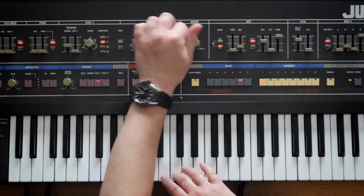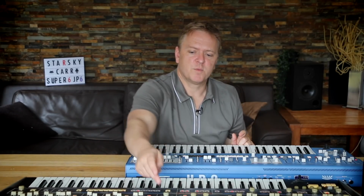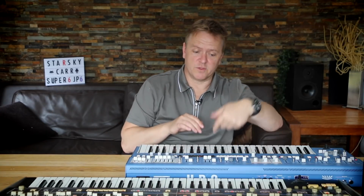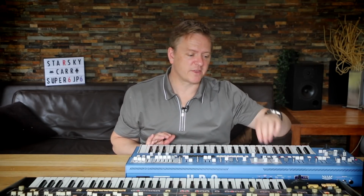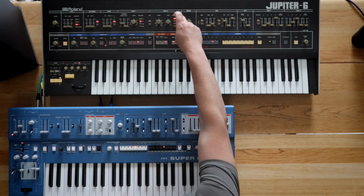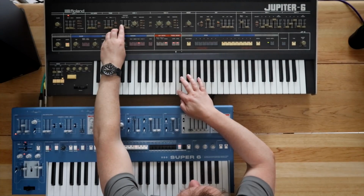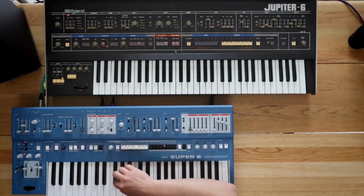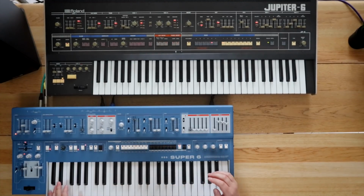If we modulate this one, for example, we're listening only to oscillator 1 there, but we can hear the different waveforms changing. The cross modulation on this one, we're not changing the modulation at all by changing the wave shape. DDS2 is actually on, which I think, after playing with it a little bit longer, sounds to me like it's just a triangle. And the reason I think that is because when I put this on a triangle, I can match them up almost identically. So let's try that. They sound very similar, so I'm convinced this uses a triangle now.